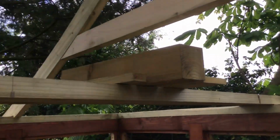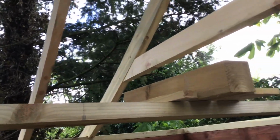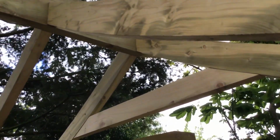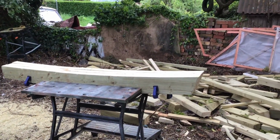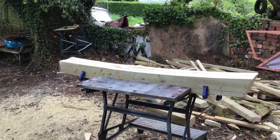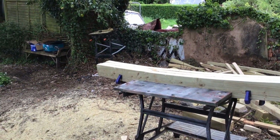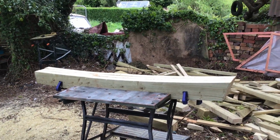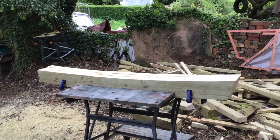Okay, this particular rafter goes up to the ridge, if you can see it. There we are, right the way up there. Anyway, they've been cut with the circular saw, the basic shape, the basic curve. Now I'm going to get the planer. I'm not going to show it, I've shown you the planer before. Plane them down to the correct symmetry and curve underneath, on top, and then plane the roughness out of the timber, and then sand it down and fit.